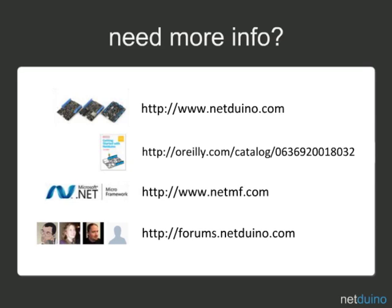That's right. There's one nuance though on the .NET Micro Framework. I think people coming from the desktop who are using the Micro Framework tend to forget that the microcontroller doesn't have the same amount of resources. It's almost deceiving. So you need to be a little bit more careful about how you new the objects, and sometimes you have to know when to call the garbage collection to avoid some low memory problems. What, no 20 megabyte buffers?